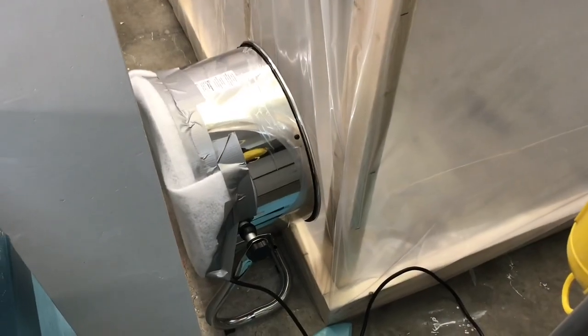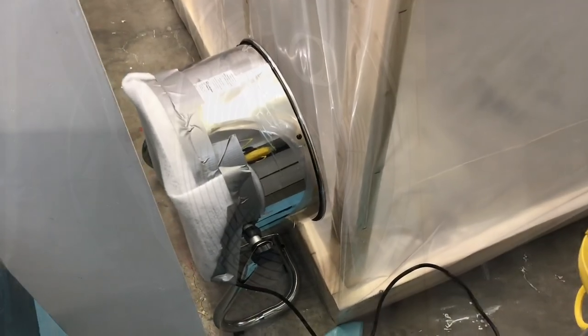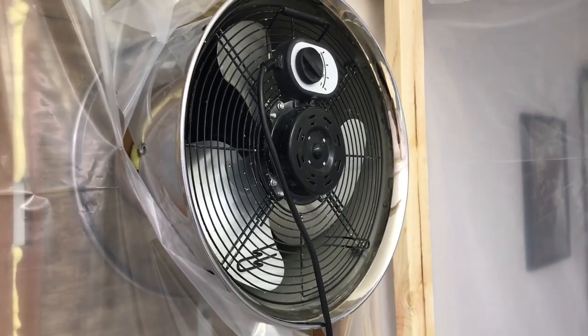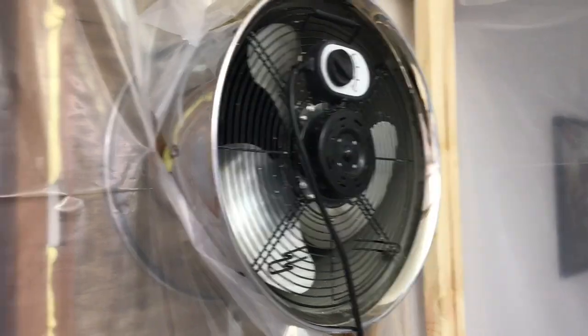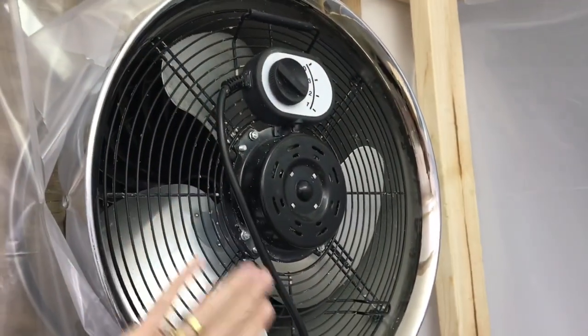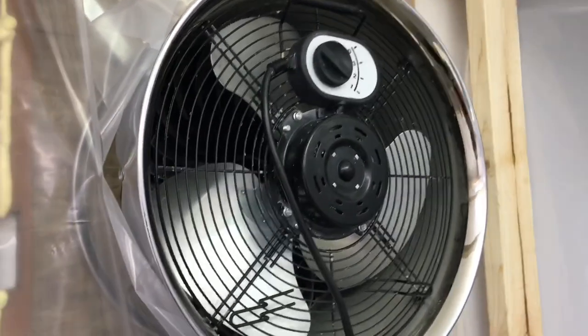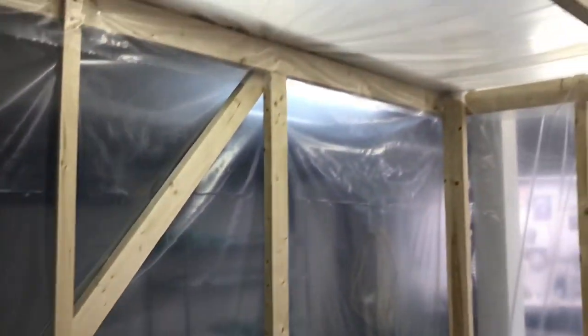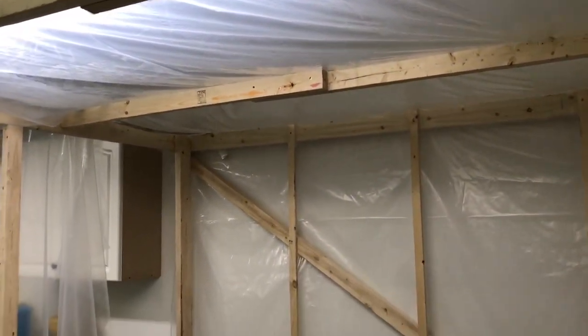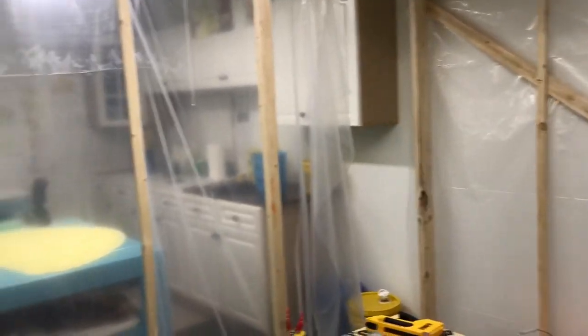This fan here is going to be the air intake for the spray booth. This is the exterior fan that will blow air from the inside of the spray booth to the outside. When it's in operation I usually have a filter on the fan here just to filter out the silicone before it goes outside. This spray booth is looking pretty good — it's just a 2x4 cube that we stapled plastic to. I have to go around and tape it down a little bit more just to seal it a bit better, but this is basically going to do for me.